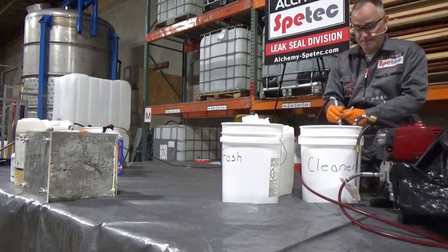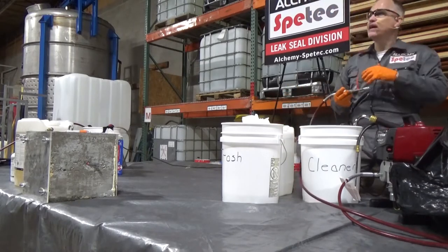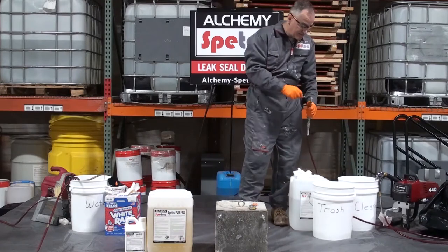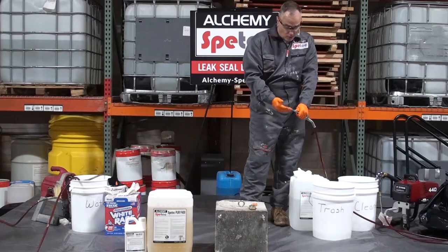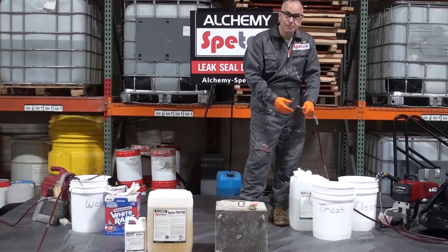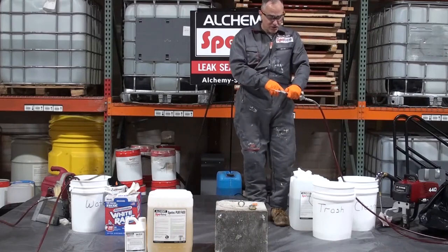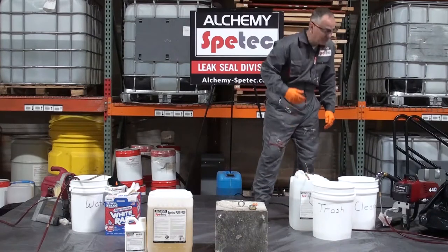I'm going to turn my pump all the way down and relieve the pressure. That's a good habit. The other habit I like is to have an extra packer on hand, and whenever you're not using your gun, go ahead and put that packer in place. Grout can get in the teeth of the grout coupler and clog it up, but if you put the packer in there it won't clog. Swapping it out is only five minutes, but it slows down production. Little tricks like that keep the job moving forward.